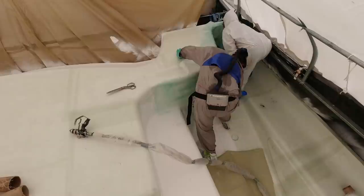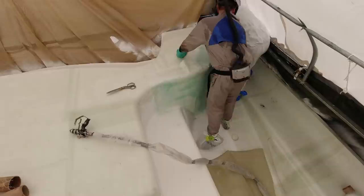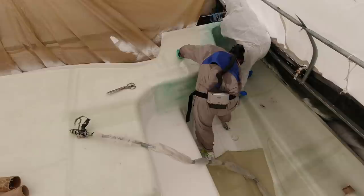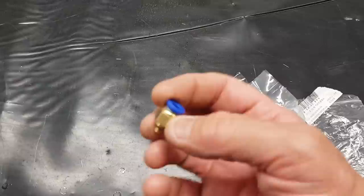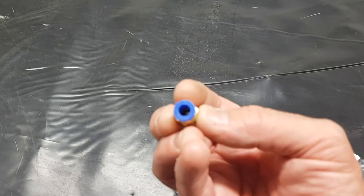I set about to fix it today because I just lost my rag — up there on my knees after six hours of laminating. There's nothing more frustrating than laminating for six hours sweating, wearing a bunny suit and respirator with acetone all over your hands. The fitting in the rear of the gun is a six-millimeter air hose fitting — like a push-lock shark bite, a John Guest water fitting — and over the years it got filled with resin and failed.